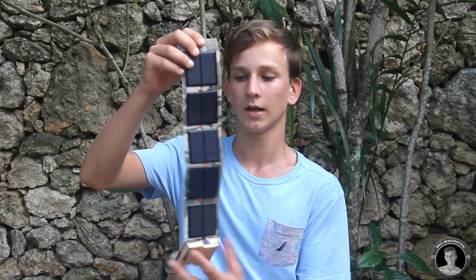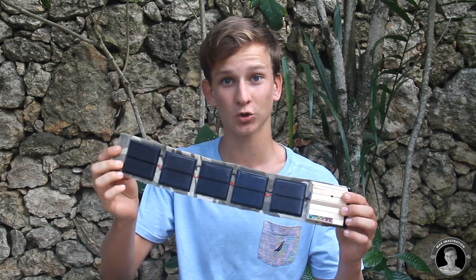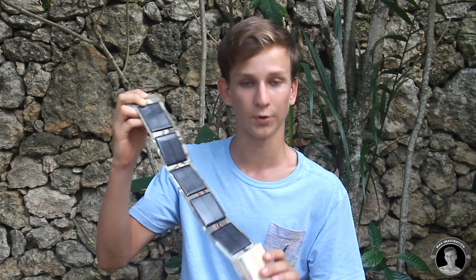What's up guys, it's Max here. In this video I'm really excited to show you all how to make a very useful emergency solar panel charging station. It folds out to five solar panels, which is an equivalent of 30 volts — six volts each, six times five. It converts down into five volts to charge any cell phone or other five-volt device, and it all folds up to fit inside your pocket. Let's get started.